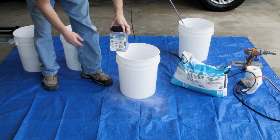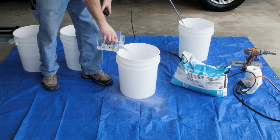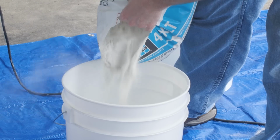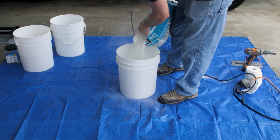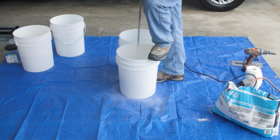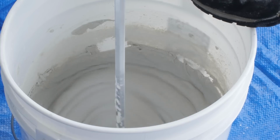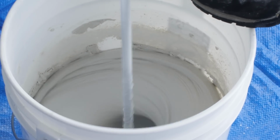After the layout has been completed, you may begin mixing the thinset provided with your kit. Look over the directions on the bag. Add the ratio of water specified on the bag into an empty bucket. Add the contents of the bag and mix with a slow speed mixer for 1 minute or until a creamy consistency has been reached. Allow the mortar to rest in the bucket for 5 minutes.